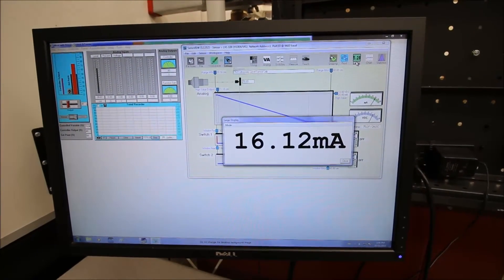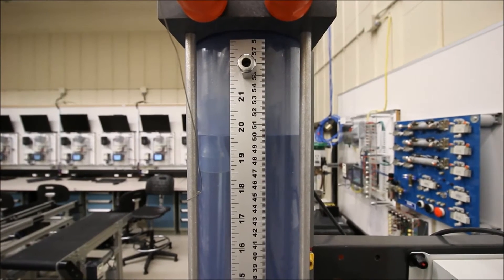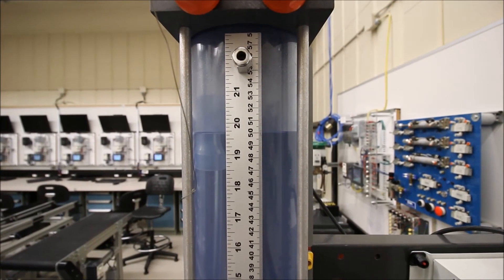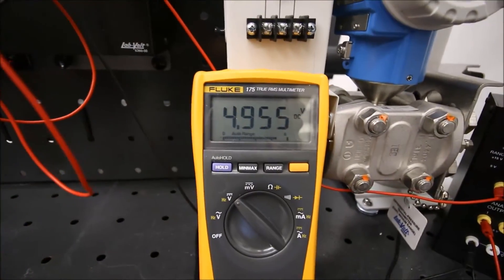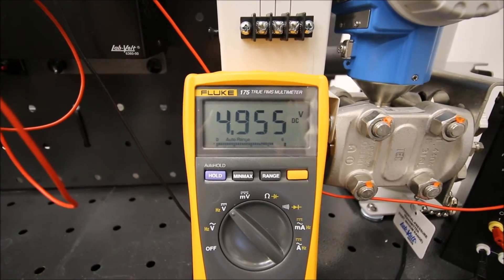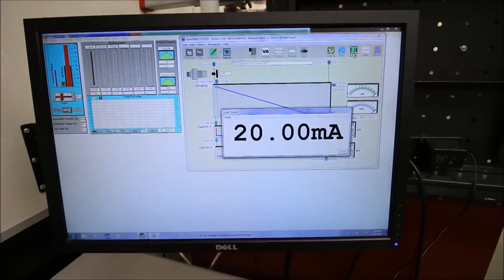Last step guys — we'll go up to our highest end of the range. We're at 50 centimeters now, having a 1 to 5 volt signal correspond to a 10 to 50 centimeter range. So at 50 centimeters I should be seeing 5 volts. Gorgeous — 4.955 volts, that's as close as I can get it. That 4.955 is coming from the fact that I have 20 milliamps now flowing across the 250 ohm resistor.